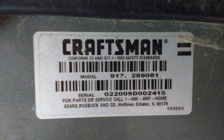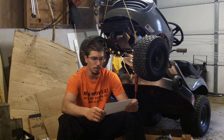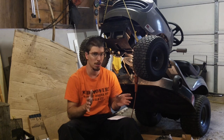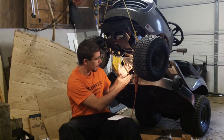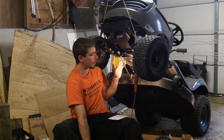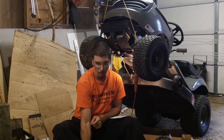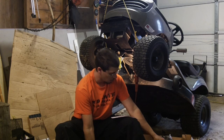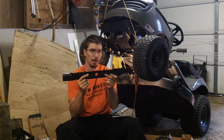This particular model that we're looking at — I'm going to post all of these notes at the end of the video — is a 917-289-081. The five-second way that you tell is you take a look at this front bar. If it has a singular front bar, it is the newer style with four bolts. If it has two tabs and two bars running back, it's the triangle type with three. Both of these use the exact same blade holes, so any blade you have will swap onto all of them.